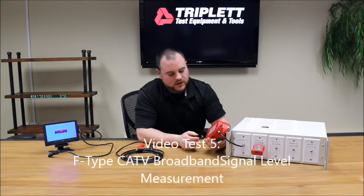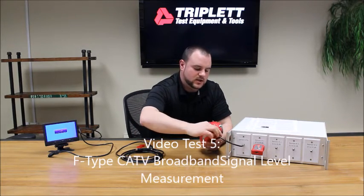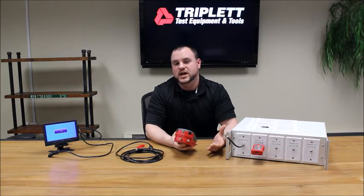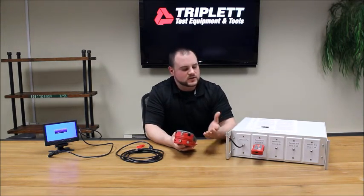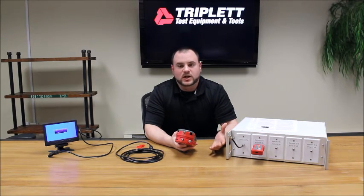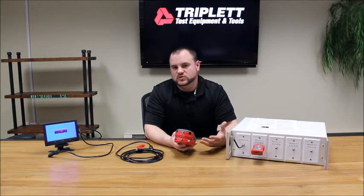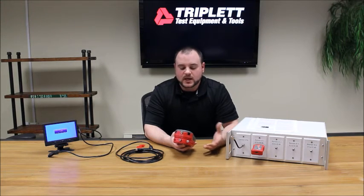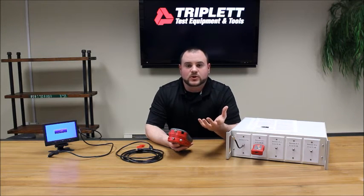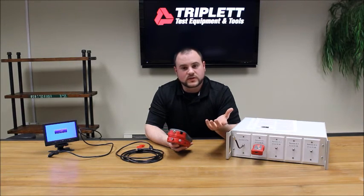Test five lets you plug directly into a wall coax outlet to see if there's any dB level signal coming in from that jack — checking if it's a live coax F jack. If you have broadband internet or cable TV on that line, you'll be able to see if it's actually live. If nothing displays, that means the line is dead and you may need to reroute it. If a dB level does display, a signal is coming across — but it needs to be within the right parameters, since too low or too high will cause issues.